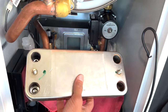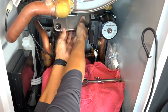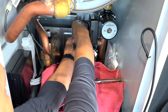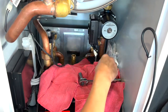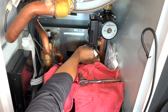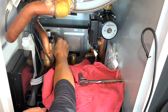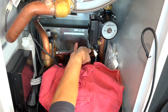At this point, we can reinstall our plate exchanger. The best practice here would be to keep the tappings facing up to reduce any water drop onto the electronics. Setting the plate exchanger back in place with the mounting studs coming through the mounting plate, we can then refasten with the 13 millimeter nuts and draw the plate up evenly.